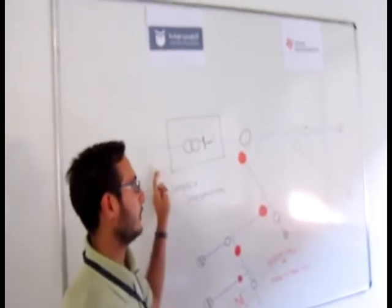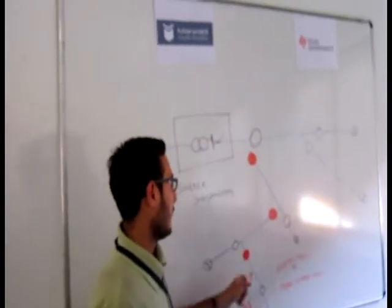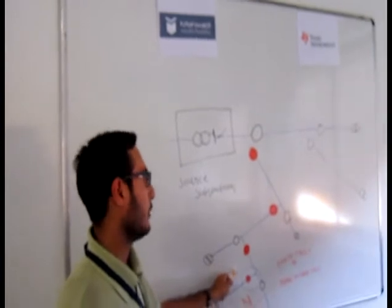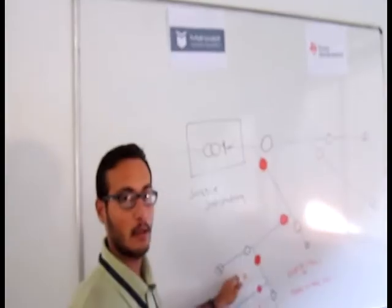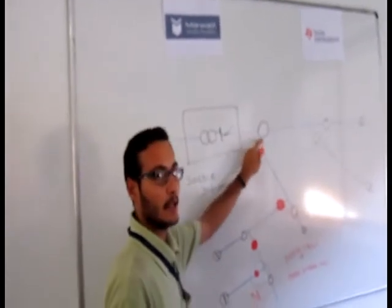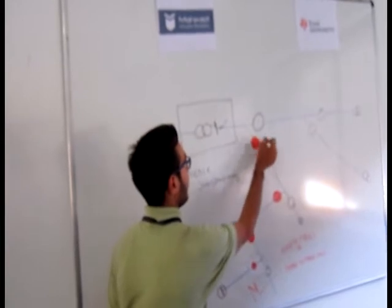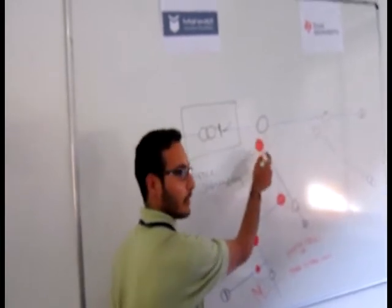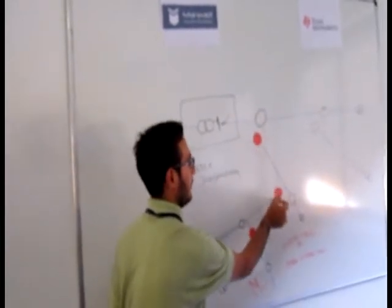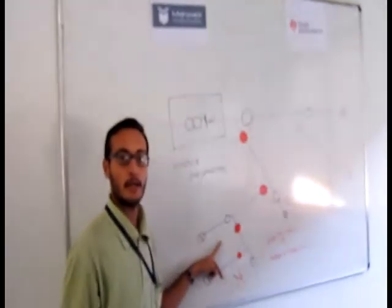But when the fault detector is installed in the network and phase-to-phase faults occur, the LED will blink in the network as shown. Here the LED will blink, and the line person only follows the blinking fault detectors, and will detect the fault in a very short time.